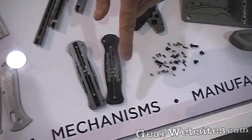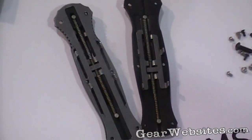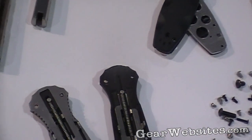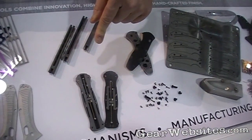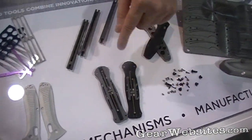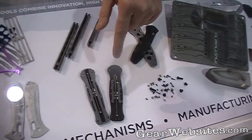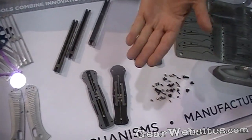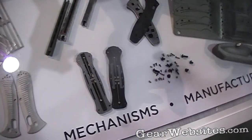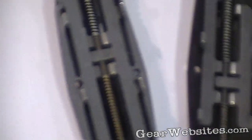This shows more so the mechanism than the manufacturing. This is the size of an Infidel 3300. That's probably our most complex mechanism — it has the most complex as well as most precision required. All heat-treated internals — the accuracy of that slot determines the reliability of the mechanism, so that's very critical. All these other features all go toward the timing, accuracy, and strength. There's also a mechanism that latches the blade when it comes out, which promotes the strength of the product.